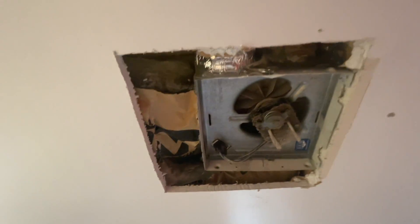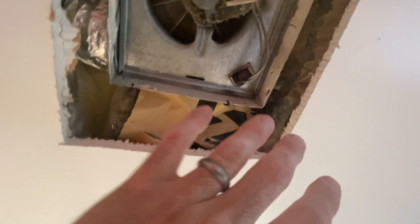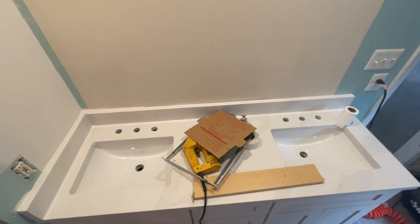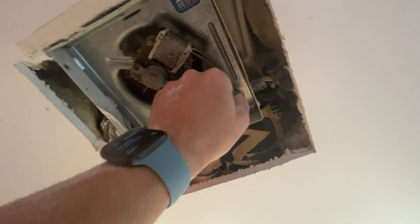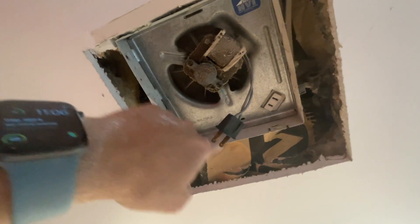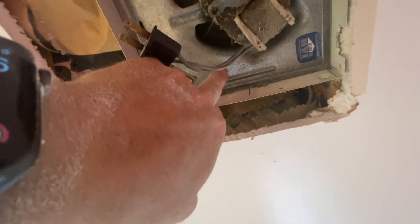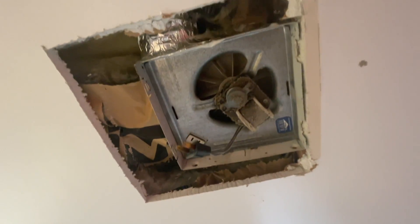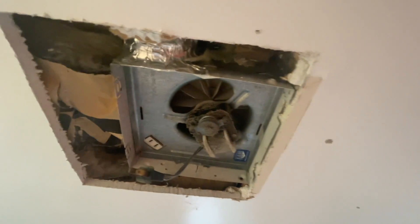Welcome to the exhaust fan with more access. Now right over here we have a three-inch duct, which is fine — it'd be better if it was four, but such is life. Electric is on this side. The reason why they make the Panasonic fan a little bit bigger is you have access to remove all this old exhaust fan. So I'm going to unplug this and then take it off — you just have to pry it. There's a little finger that sits in the metal; I'll push that back and pull it down. Because right here, I just unscrew these, and then I can unscrew this exhaust fan from the rafter and it'll come down, and then I can disconnect everything.